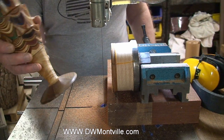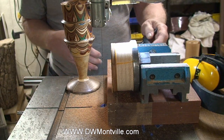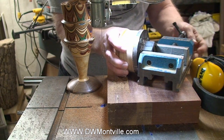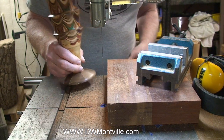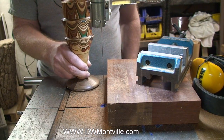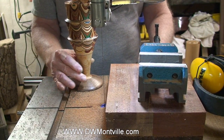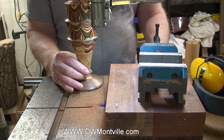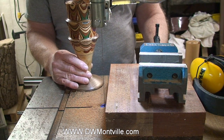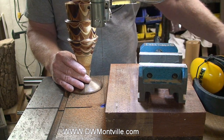And you see we're done. So it's off the faceplate successfully. That's always good. And the next step now will be to move back to the lathe and set this up with a scroll chuck and a steady rest. And I'm going to walk you through that and my reasonings behind every step right now.